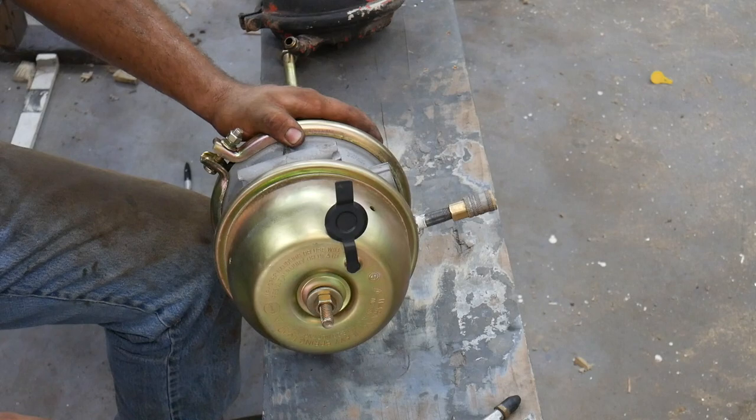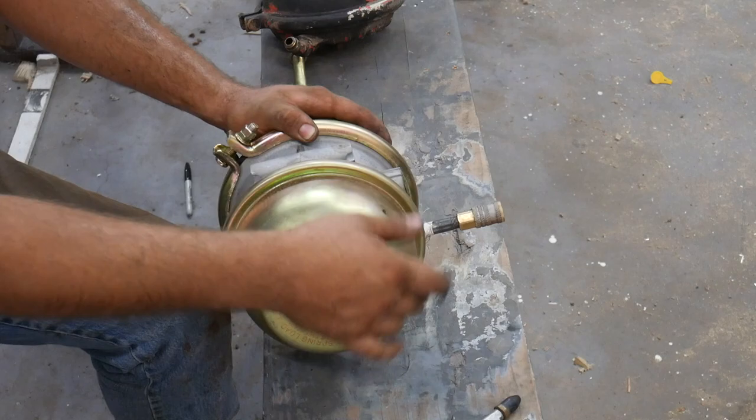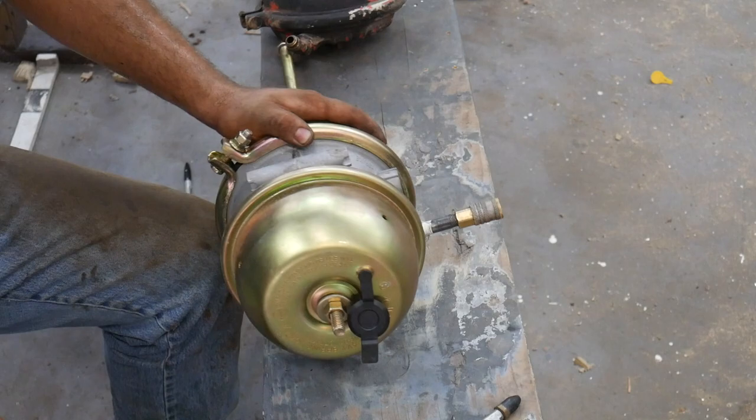And that's not something you typically ever have to do unless, you know, if you lose a brake chamber, I suppose you could pinch the airline off and cage the brake or something like that. It's not legal to go down the road with it, but a wrecker might use it, or if you've got a junk truck you're trying to move.